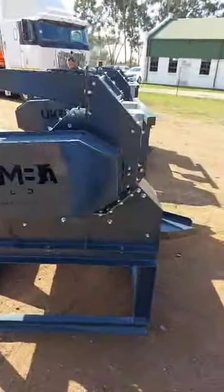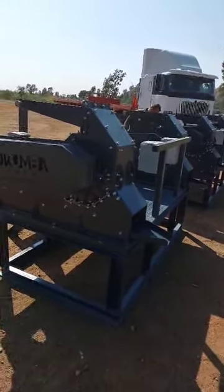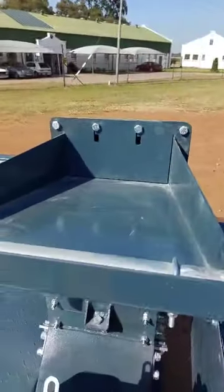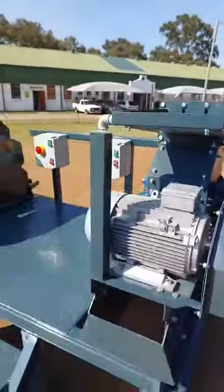Capacity of these dual stations is up to about two tons, maybe more, just depending on the material spec and discharge chutes. We have removable chutes underneath. You have a retention plate at the top of this hopper for your material sizing, and a spray bar to connect water to.